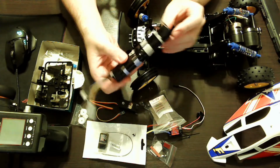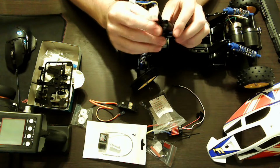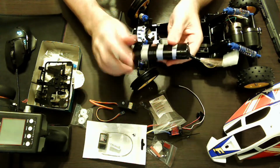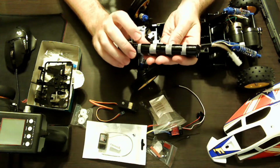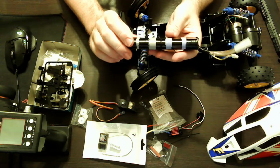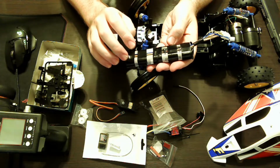And I know it looks kind of jank, and the only thing is I just don't have the shrink wrap tubing to cover this whole thing, which I'll need to go online and buy. But this is basically a 2S configuration. This is actually a mismatched set with just one mixed one, but I'm not too worried. These gray batteries came out of a pretty extremely solid battery pack. I think it was an IBM, I can't remember, or also a Toshiba. And I did a charge on all of these and then matched them and put this together.